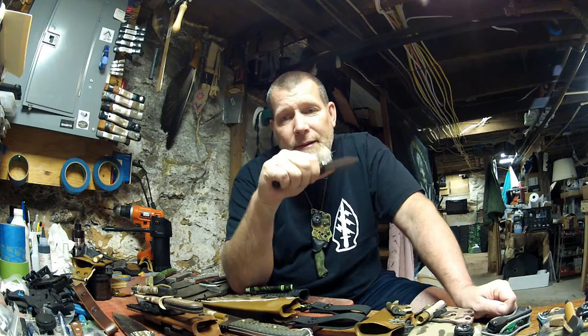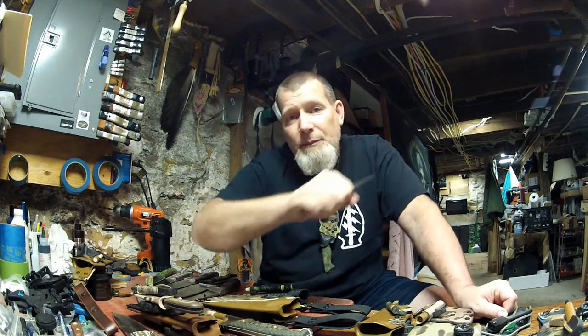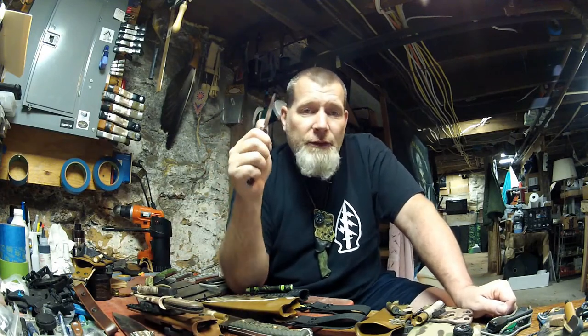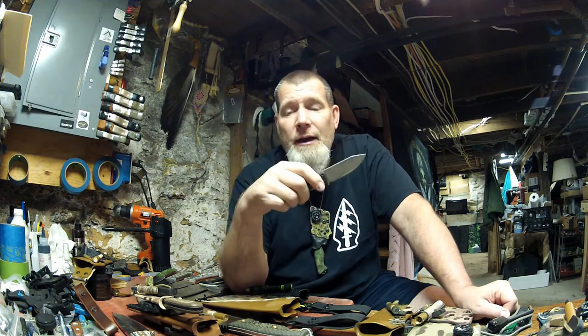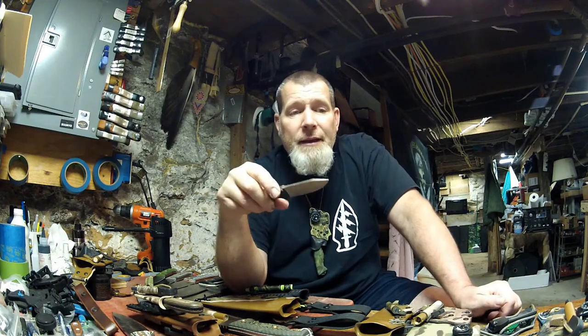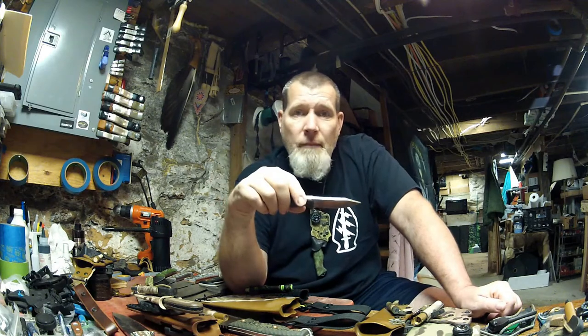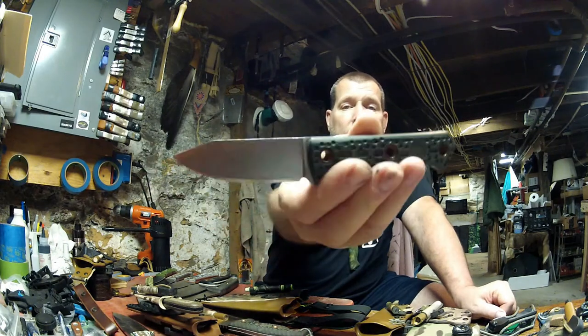Because, in my opinion, the ability of a knife lies in its ability to slice various materials evenly, precisely. And that's what this edge does for me while still being very strong. So it's much stronger than a Scandi edge. It's stronger than a regular factory edge because it's got more meat behind it. It's a great edge. And I'll teach it to you if you want me to. If you're interested in my low shoulder convex grind, I'll teach you how to do it. I'll show you how to do it. It's not hard. All right? I would imagine there are guys out there already doing it, right? They just don't call it what I call it. Anyway, all right, so there's the knife that he built for me.